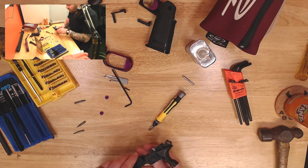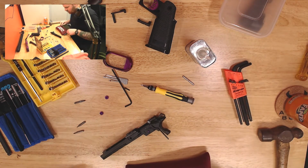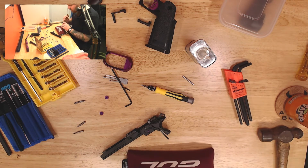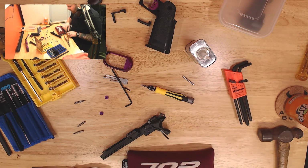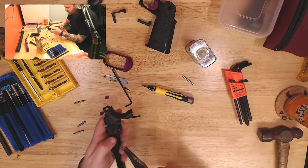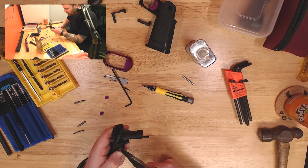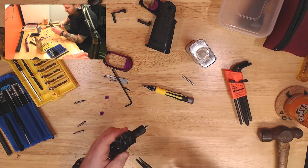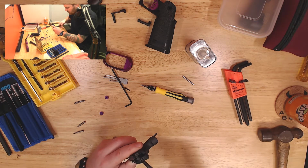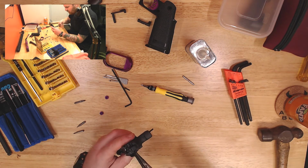So hopefully I can... I mean, if this was a really bad one and that was completely flush, what you'd probably try to do is get some kind of stud extractors into it. Now I don't have stud extractors, but what I am going to try and do is nibble it out with pliers. Because it wasn't tight and there's no tension on this screw, there's nothing really stopping it from turning. So that is turning, thankfully. Oh boy, thank God for that.